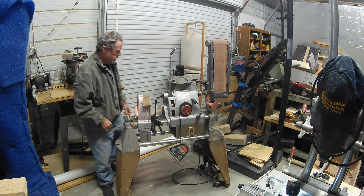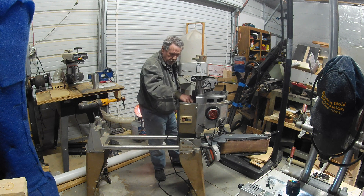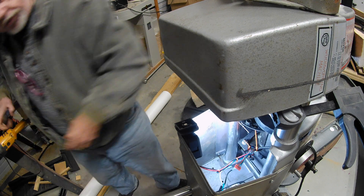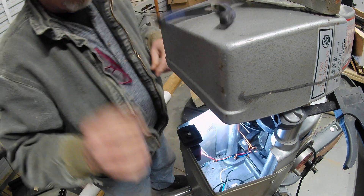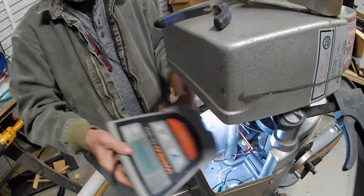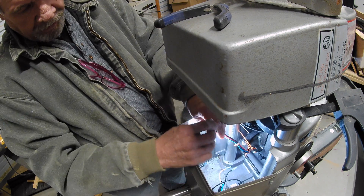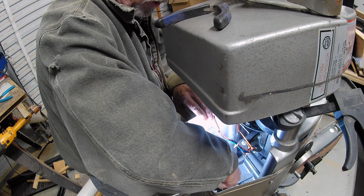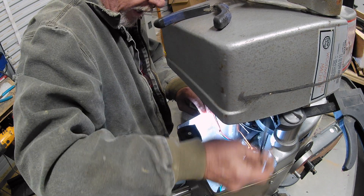We're going to unlock it right here, then raise this up. We've got to get in here and get a hold of these wires and hook them up to go to the new machine. First thing we've got to do is remove all the treadmill components because none of that's going to go to us anymore. We're starting over. These are the two motor wires right here. We're going to pull them out and get them out of the way. The control board goes to that pile over there. Now we've got to have these two wires going to our rectifier and switch. Down here in the bottom it's still got this choke — I'm going to keep that for right now because I'm thinking it might help make this thing run a little smoother.